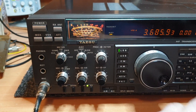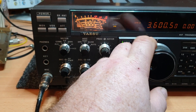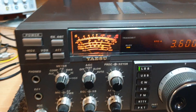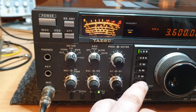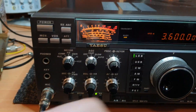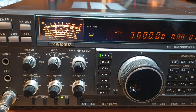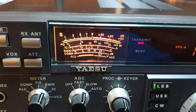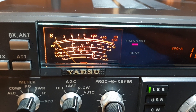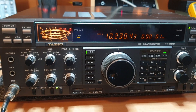We know on 10 meters it'll be fine. Three and a half MHz — that's asking it to do an awful lot, but we will try. Let's look at this SWR meter — it's going to skyrocket then try and sort it out. And it does! Whilst that would not be a very effective antenna, that tuner just tuned it in a split second — that's really revealing, actually, very good. I'm tempted to try 10 MHz as well. We hit the tune button — it's gone really high and bingo, the light's gone off. So what do we think of the FT990 tuner? I think they're pretty good.